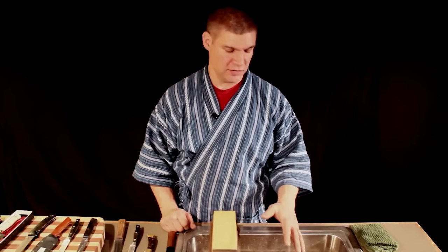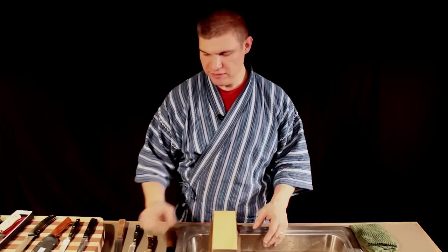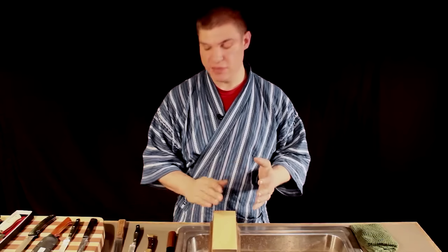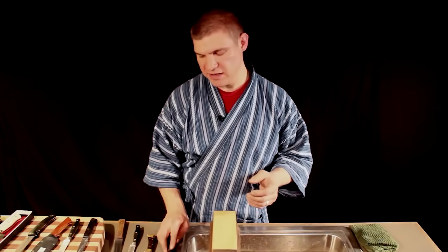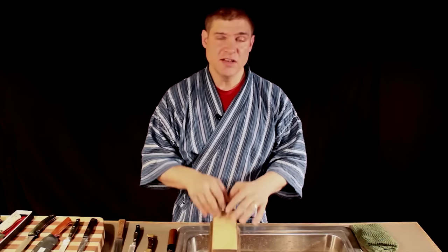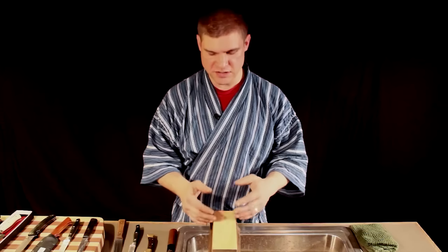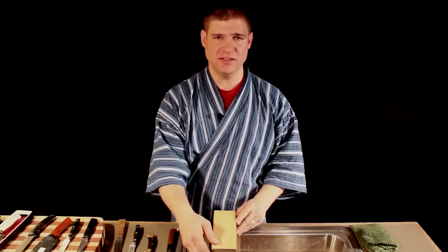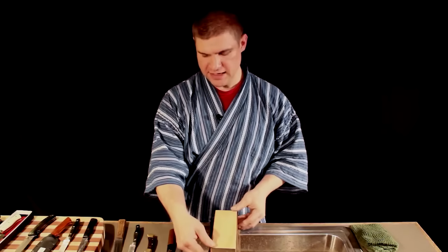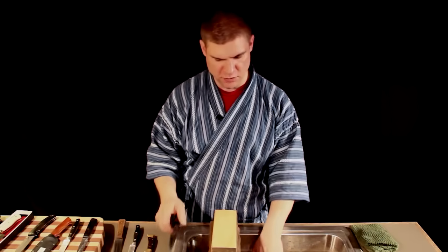Now it's really important, guys, that you slow down for steps 4, 5, and 6. Because if you've done a sloppy job on those, if you're not getting that biting sensation in your fingers with the 3-finger test of edge sharpness, and if it won't cut into something like a tomato skin, then all of the stropping and honing on the 6,000 stone in the world isn't going to improve things. It's just not abrasive enough. If you have to, go back to that 1,000 or to your rough stone and keep working until you get that good primary edge. But we've tested all these knives and we know we're ready.